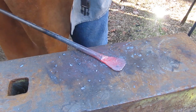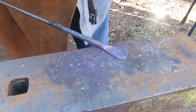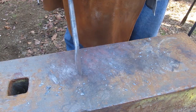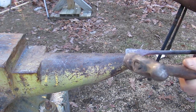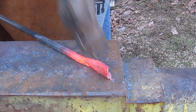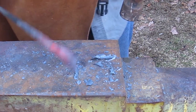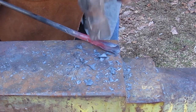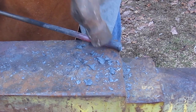I'll show you a little bit more. Now I start the curving of the fishtail on the horn of the anvil, just to get a little bit of a start on that curve. The most important thing here is to work on this part right down near the rod where the point will be on the arrow, because we're going to try to fold that over and force it out — that's going to be closed up. We don't want to completely close up the outer end, the open end of the cone. So work on the steel down there, forcing it and hammering it in a direction towards the end of the arrow, over the end of the point.